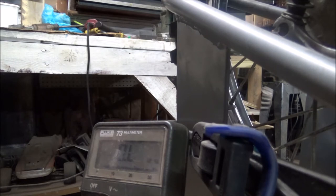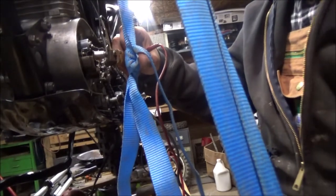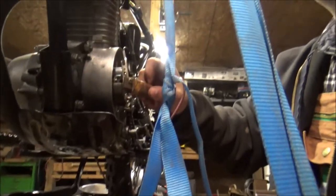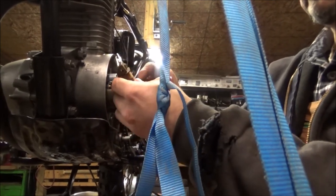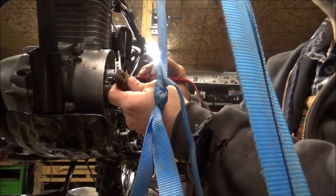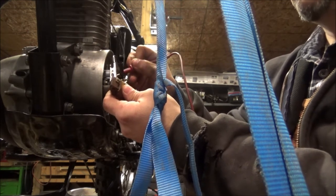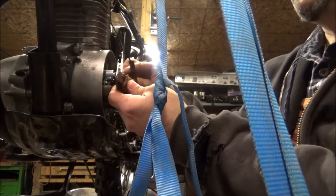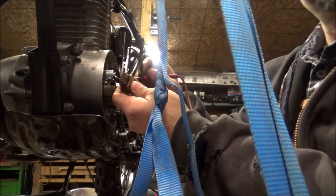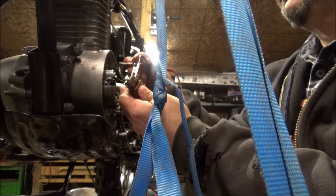Maybe the coating is still on here enough. What I've got is the wire on the coil, grounded over here to the side, and I'm touching it right where the copper is peeling off — and I'm not getting anything, same thing zero. But if I touch it over here where it's soldered on, then I'm getting 2.0 ohms. So that's kind of interesting that it's actually showing there where the copper is peeled away. I don't quite understand that, so maybe one of you guys could tell me why it's doing that.